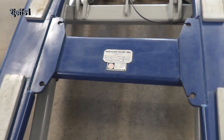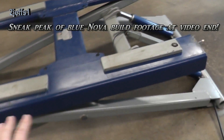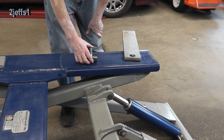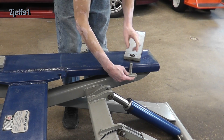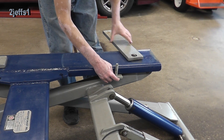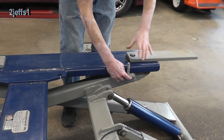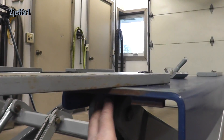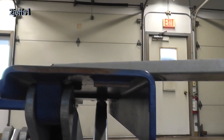I've had this for a while — it has been repainted once already — but I like the basic design where they had the dual ram and how they structured it. I knew I was going to be making some changes. The first thing I changed was these arms. They originally bolt here, mounted through here, sliding behind with a little stop welded so you could only go a certain amount of degrees. You couldn't put this plate toward the front, as that would be totally unsafe. Now the bolt comes through with the arm facing front, and there's plenty of support from this arm and the channel.